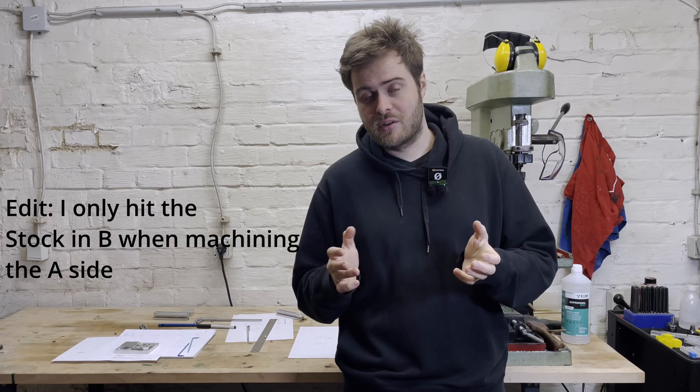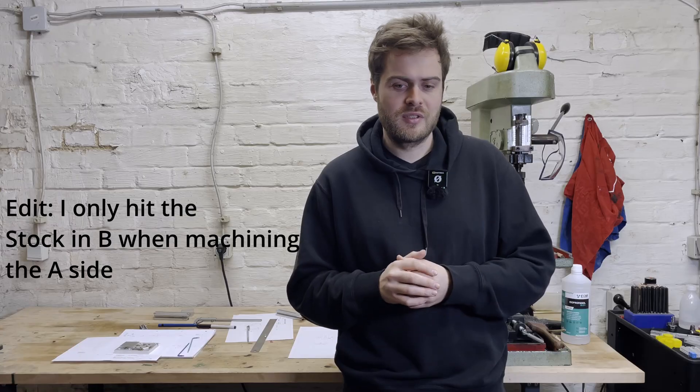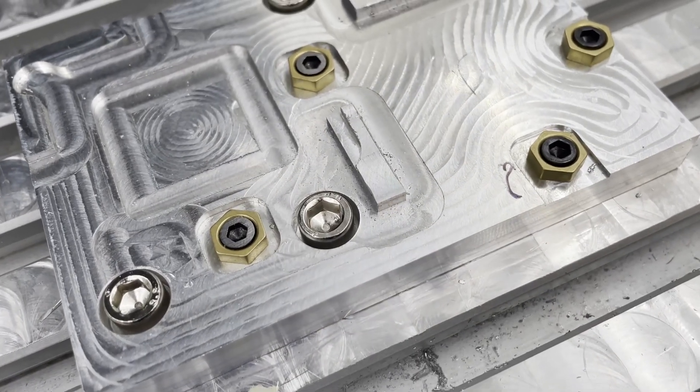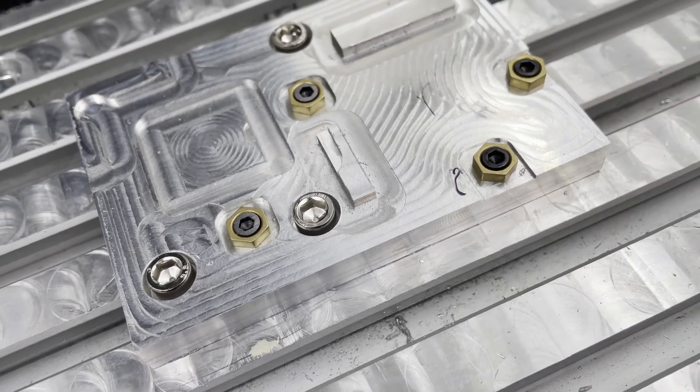There is not really a lot of material to hold onto. If I were machining just a couple I would probably glue the parts to a flat surface, but this isn't viable for doing more than 20 pieces. A vacuum fixture could be a good option, but sadly I don't have that capability right now — something for the future. I ended up needing to make some clearance adjustments to the fixture: filing down some bolts so they don't stick out, and relieving some of the fixturing by running the G-code without any stock to remove extra material. For now the process should be quite refined and I can start my first production run with some T-style clamps and time the whole process.